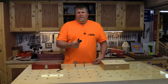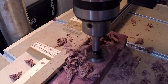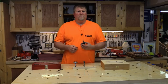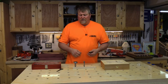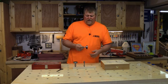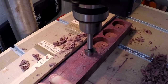I put the fish bit in — same size, same material — and I was able to drill the hole a lot faster. It was super clean, and when I got done, the bit was not hot at all. I went ahead and drilled a third hole. After I got done with that, the sawtooth bit was still hot even though it had been sitting out there. I also cut one with the knife edge bit. It's smaller because that's where my kit starts, at about three quarter inch. This one cut slow as well.